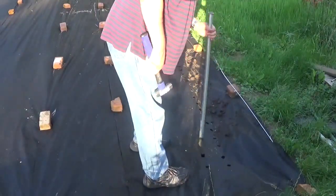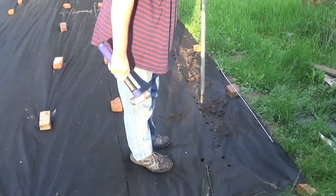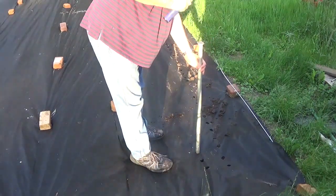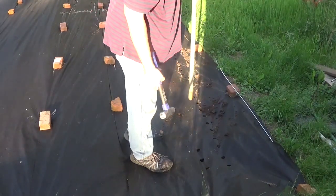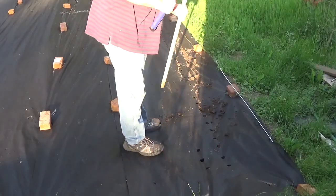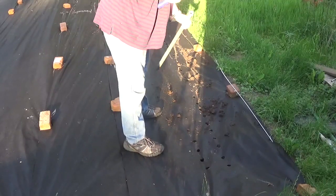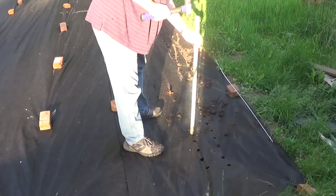Just take it here and pound the dirt out of it — look through, see it's clear. This is maybe one inch steel conduit. I use this type of hammer because a claw hammer just doesn't have the weight to give that oomph. Just show you how easy it is — good whack, one or maybe two. Round it out. Very quick.